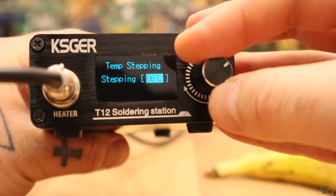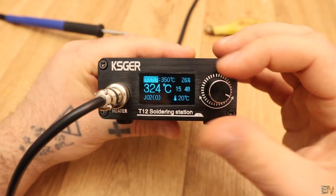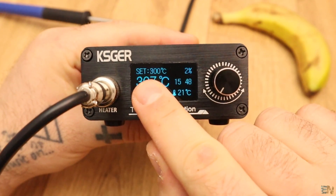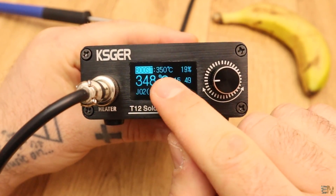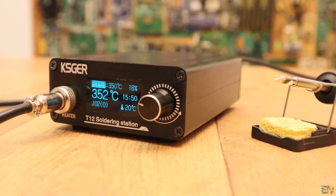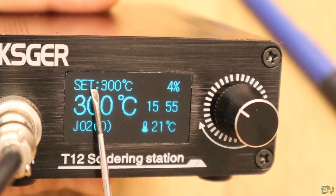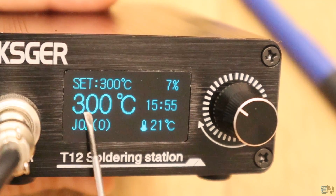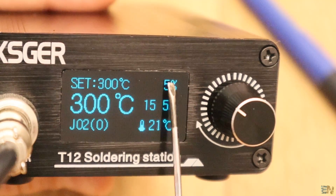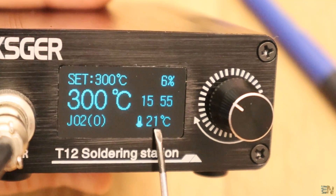When you're not in the main menu, on the front panel, when you rotate the knob to the left or to the right, you could change between 3 modes: Standby, Set and Boost, and you could set 3 different temperature values for each of these modes so you could switch between temperatures faster. On this front panel, you could see the selected mode and the set temperature on the top corner and the real temperature with big numbers. We could also see the power percentage applied to the iron tip, the time, and also the room temperature on the bottom right corner since the chip inside also has a temperature sensor.